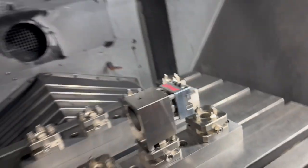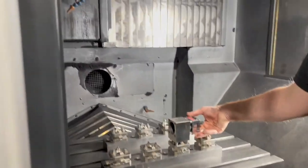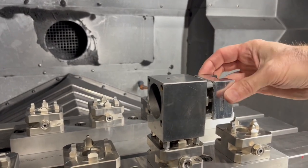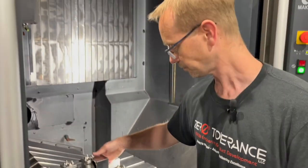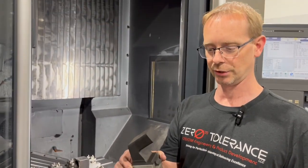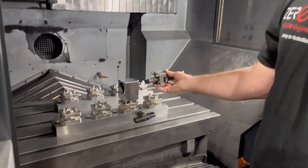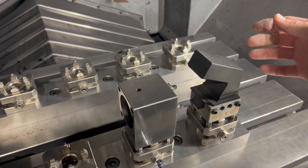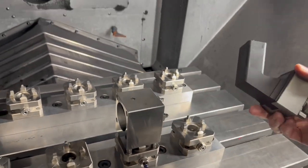This is a really useful tool — we do this all the time. Saves time, saves money. Just to add to this method, I want to show you how modular it is. We got done with that, flip it over, we can do the same thing on the other side or with the 90-degree. So you can hit five sides with a three-axis machine fairly quick and easy. Here's an example of an electrode we really had to use this setup for — it's very unique. It's a vector burn going in on a 30-degree angle, and the only way to do it was to machine it from two different sides and also the top. So it's three sides that we had to machine. We machined it this way, that way, and this way — roughed it out, then did the finished cuts. That allowed us to get that kind of vector burn electrode made.